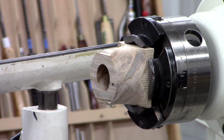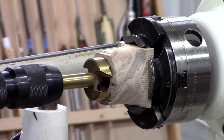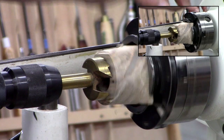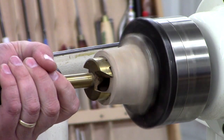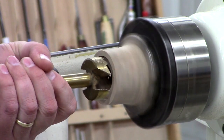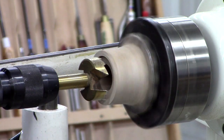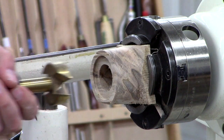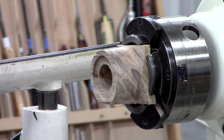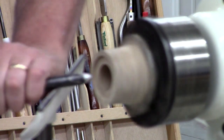Now we're going to drill a one and three-quarter diameter hole for just about a quarter inch — a pocket. The reason I do that is if you scallop the top, the acorn looks a lot better. If you don't scallop the top, then this is not necessarily a step that needs to be done.